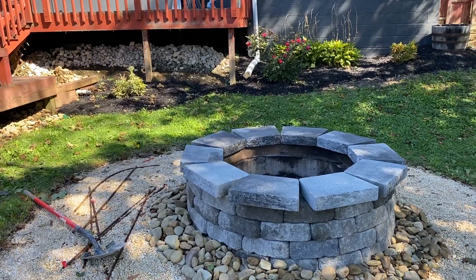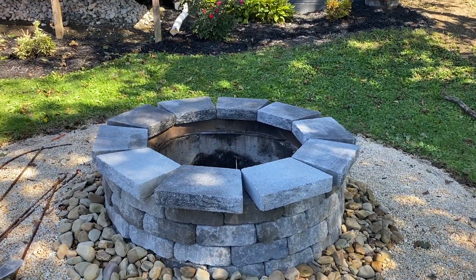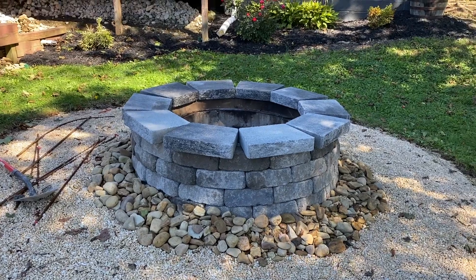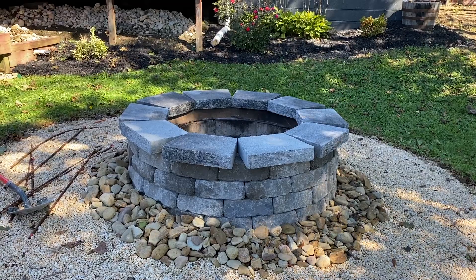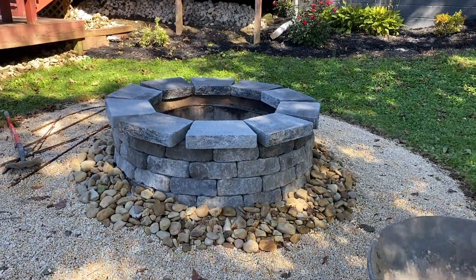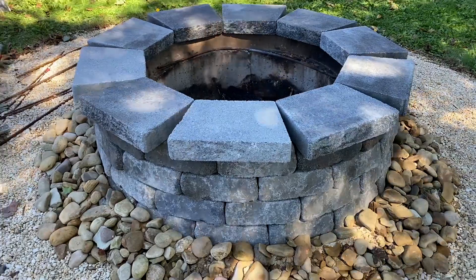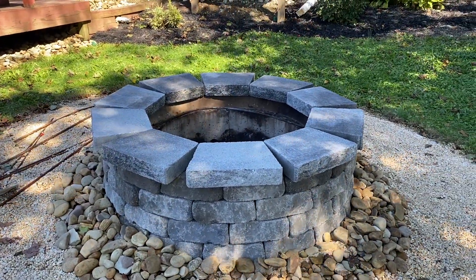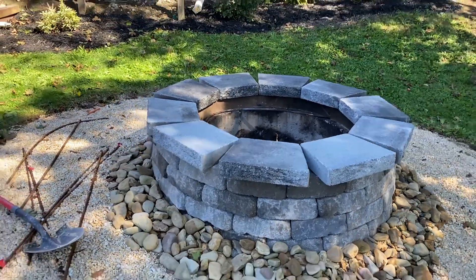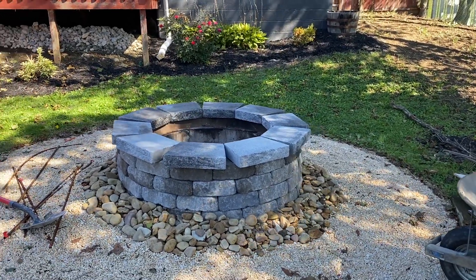I decided on keeping the block — I was originally going to cut it or find another one, but once I put it on top it actually looked kind of cool. So I'm going to leave it as is. As you saw, the longest part is your bottom row — you just want to make sure it's perfectly level and your spacing is tight, then the rest of the blocks go together really easy. If you lean them in just a little bit, you don't have to worry about them ever falling over. If you're concerned about the top blocks, they make a liquid nails product called Fuse It for outdoors — you can put that on so if somebody leans on there it won't tip over and hurt anyone. I staggered everything and it turned out great. We're in fall season right now, about 45-50 degrees — a perfect time for a fire outdoors.